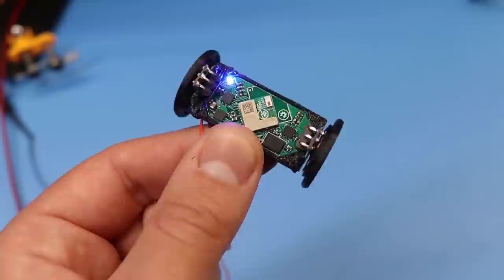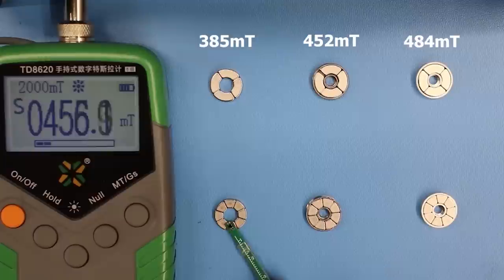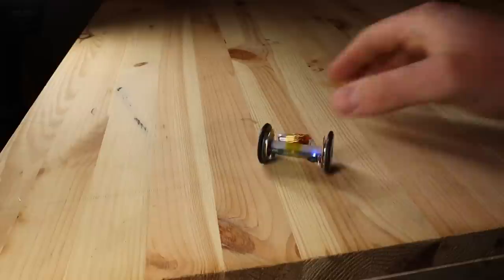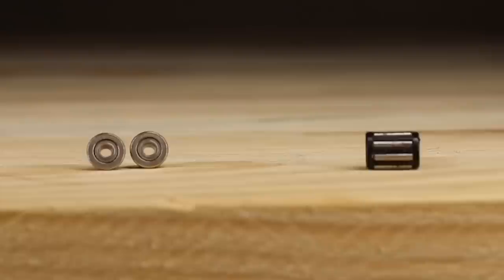One of the things that takes the most space in a robot is the motor, so my idea was to engineer a motor that is super thin but at the same time has enough torque to drive wheels. The first try was a success but mechanically it sucked, so I continued making small mechanical improvements to the rotor, which also led to an increase in torque. This was version 1.2, and the bearing still had some play which made the wheels wobble.